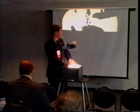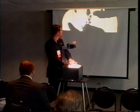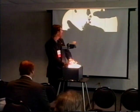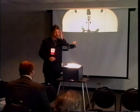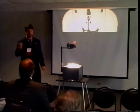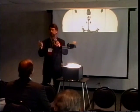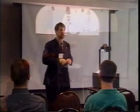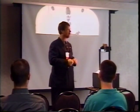Come back after you make your adjustment and make sure that your four corners have equal fork horn clearance. Very important that you have equal fork horn clearance. Now, if you didn't have equal fork horn clearance, what could the problem be? Talked about the banking pins not being straight, or one turned out further than the other. Horn could be bent. Roller jewel could be crooked.